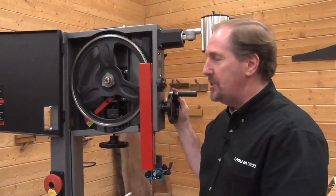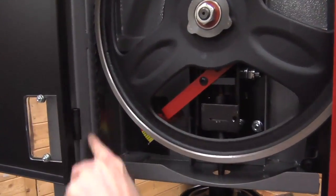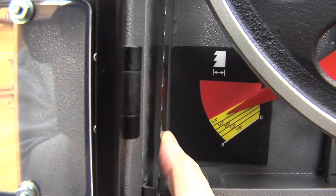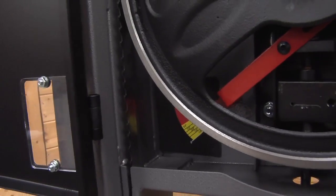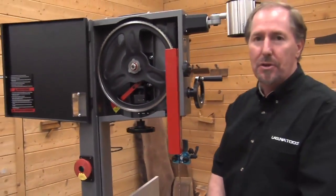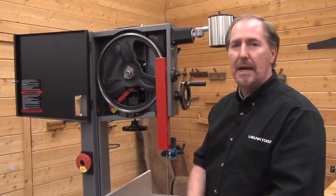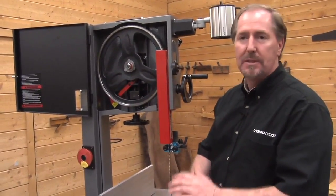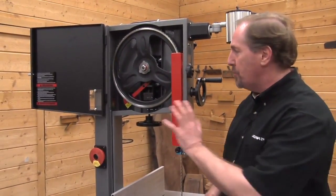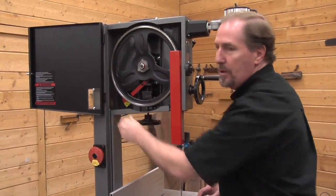While we're talking about blade tension, it's always good to check the actual tension on the blade by pushing with your thumb on the inside of the frame of the bandsaw. With moderate pressure, you want about a quarter-inch deflection on the blade — that's how you actually verify the setting. I've heard of people loosening the bandsaw blade until it flutters and then retightening it. I really don't advise that method. I wouldn't run my car with low tires, and I wouldn't run a bandsaw with a loose blade. Set your tension, verify it with the indicator, verify it with the thumb test, and you're good to go.